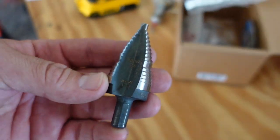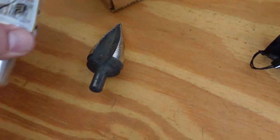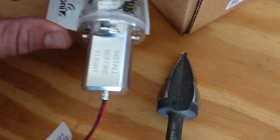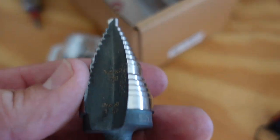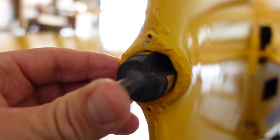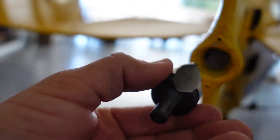We're going to be using this Irwin unibit - I think it's up to one and one-eighth inch - and that's just smaller than the width of the forward piece of the beacon. I think we're going to use this to widen that little mounting hole out a little bit, and then we should be able to use a Dremel tool to refine things. You can see we almost get the clearance that we need, and I think we can avoid touching the fabric on both sides.